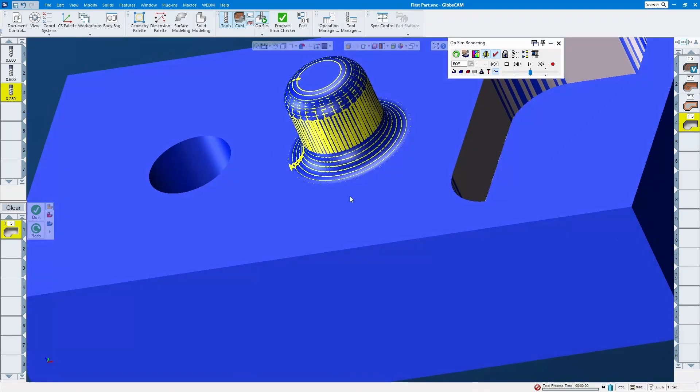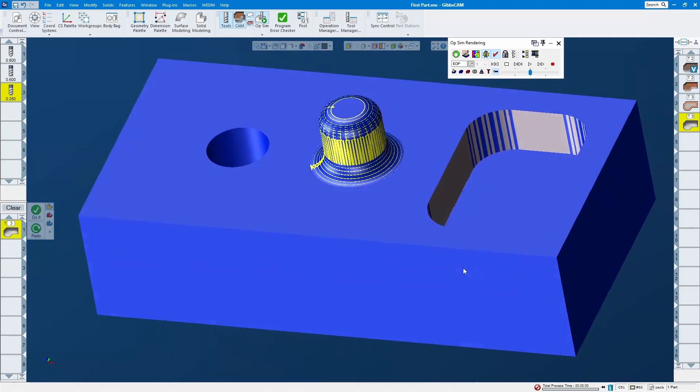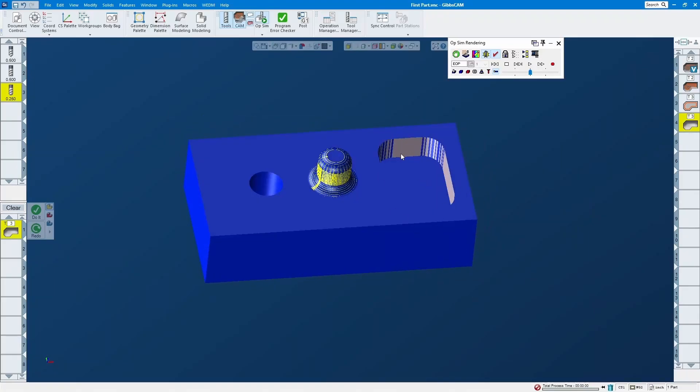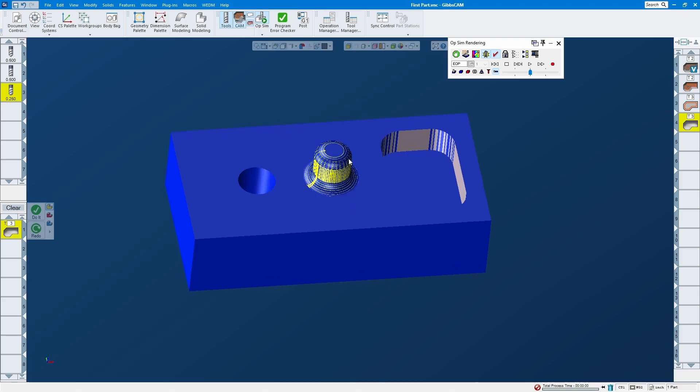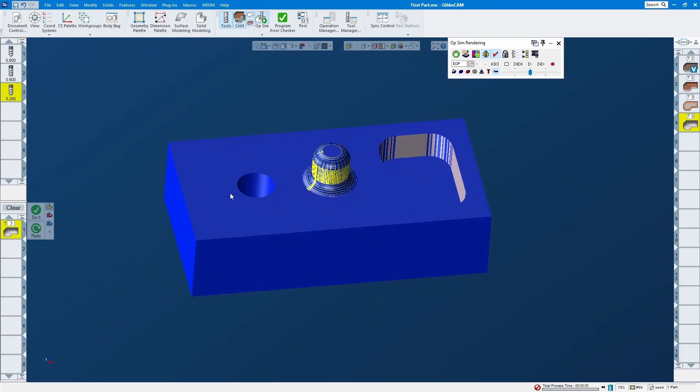Looks good. When you render you can see it cuts right on the model — that looks good. So that's the complete process: 3D pocket roughed with volume mill, pocket finished with the pocket offset pass, bottom radius done with contour, upper radius done with 3D surfacing. That should be all for this video. Maybe next video I'll create a volume mill pass to rough all this out so you can understand volume mill a little bit more. All right, see you guys next time — check this out, bye!